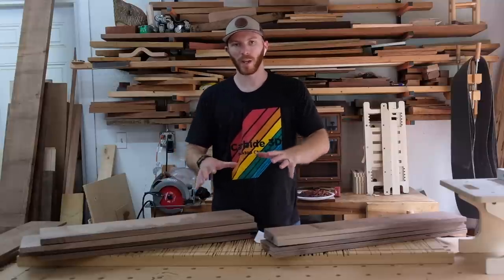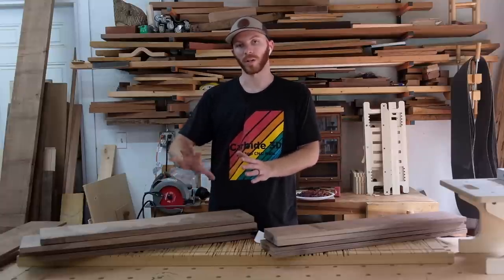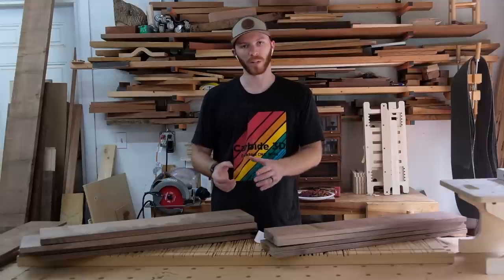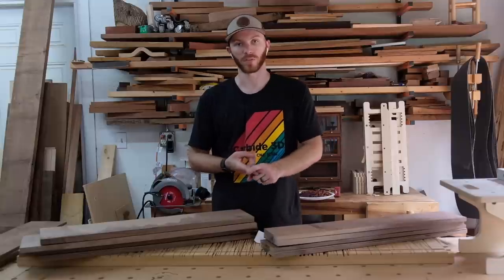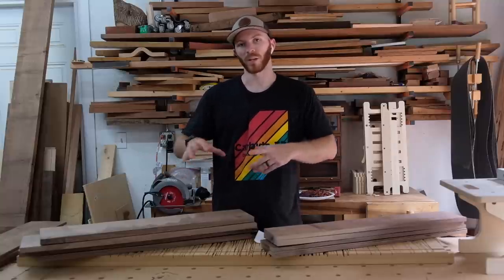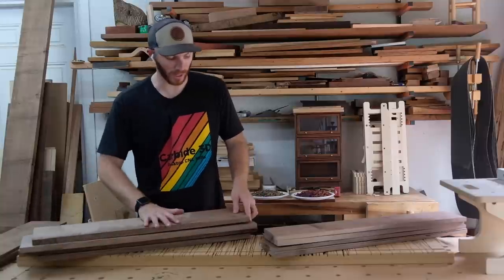That's where I'm going to end this video and this part of the build. I have my outer casework, my divider material, and some of my gridwork material all rough milled and ready to be taken to the jointer, planer, and table saw to be taken to their final dimensions. I think this was a pretty successful milling operation — I didn't run into any huge issues. Some of those boards did bow a little bit when I resawed them, but I have enough thickness that I can get them down to what I need at the jointer and planer. That's why it's always good to do some test cuts and leave some extra material as far as thickness is concerned, because you don't want to get too far into a project and have to go buy more material where the color and grain won't match up. Right here I have my casework material — I did run a couple of the pieces over the jointer just to see what it would look like, and I'm pretty pleased. There's no sapwood in any of these four boards.